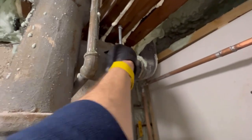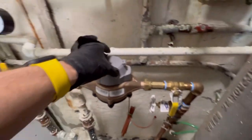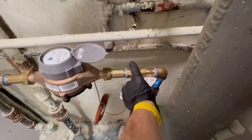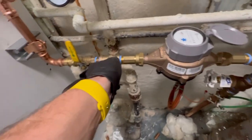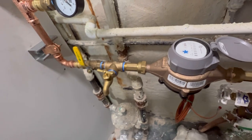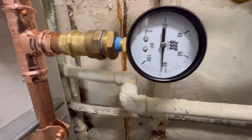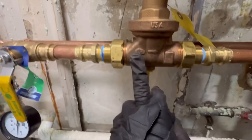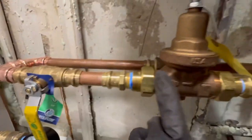The SC-12 by Amtrol, supported with some 3/8 threaded rod and a rod coupling. Three-quarter split ring hanger. Let's turn this baby on. Water is on — do we have any faucets open? Close that slop sink. We're going to pressurize this in sections — open this up and pressurize up to this part.